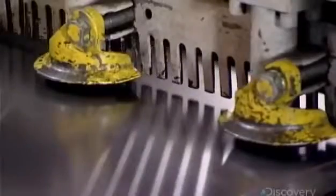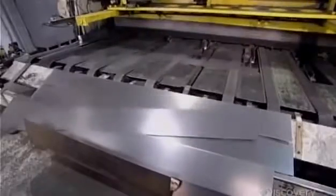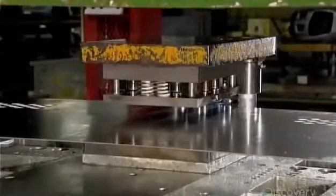Workers feed one at a time through a cutting tool called a square shear. It slices from one end of the sheet to the other, cutting pieces with the required width. Each door piece goes into a 100-ton punch press, which stamps out the ventilation holes. The next press punches screw and rivet holes around the edges and a hole for the cup that houses the locker's closure.